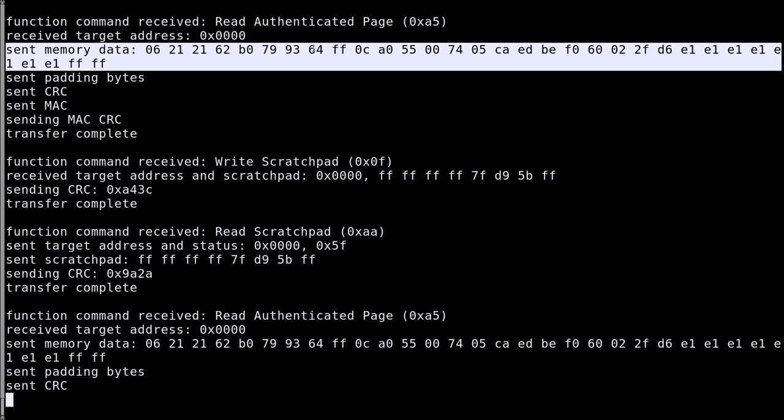Afterwards, it would probably decrement the number, the toner level, but we don't care about this. We could just accept the command of decrementing and just, in fact, ignore whatever it does. The next time it reboots, we just reuse the value which is in there. And this probably would work. But this is not the finest solution. Let's look at other ways to hack the printer.